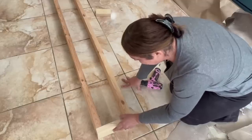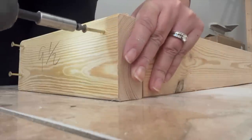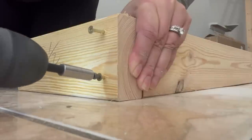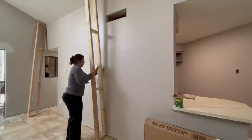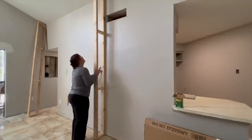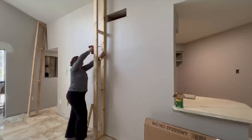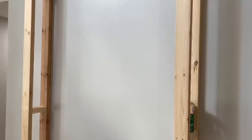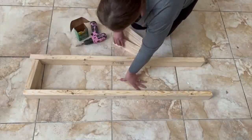The first thing I did was to create a side frame that came out from the wall. To do this, I cut two by fours to the height of the wall — one piece to go flush against the wall and another at the height of the ceiling, nine and a half inches from the wall. I put these pieces together to create a sturdy frame and added two support boards inside just to help strengthen it. I created two of these frames and then attached them to the stud locations on the wall.